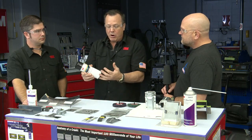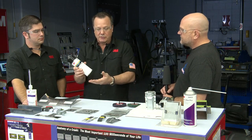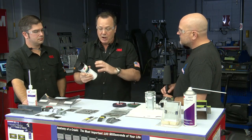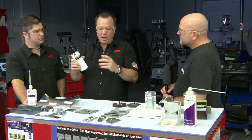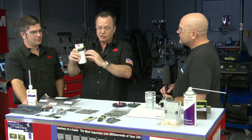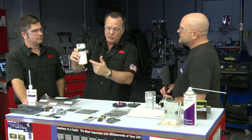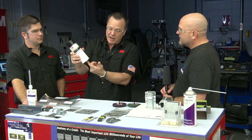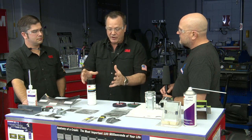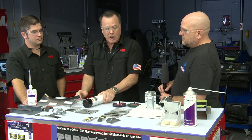It's transferring those electrons. Now, obviously the more of that zinc powder you have in here, the better off it's going to do, right? So our product has a good amount of solids in this can. When the can settles, all that zinc settles to the bottom. And think about it, you've got a dip tube that pulls the product from the bottom of the can. Well, if you don't do everything correctly, you're going to suck up all those solids into that straw and clog the can, right? So that's why I store it on its side.